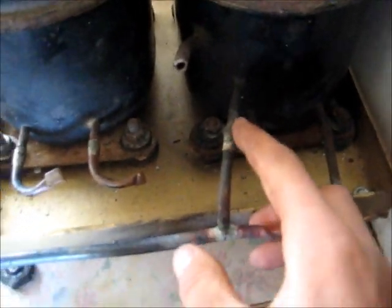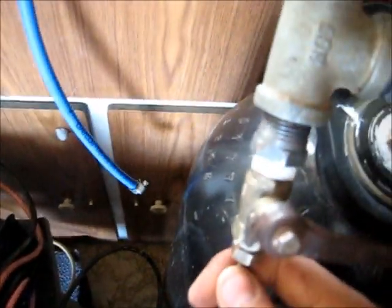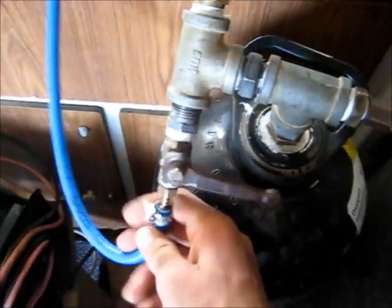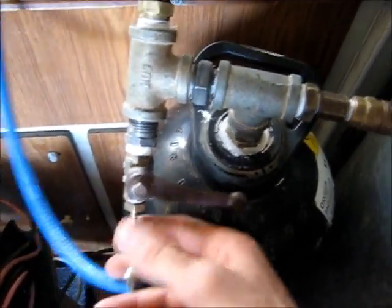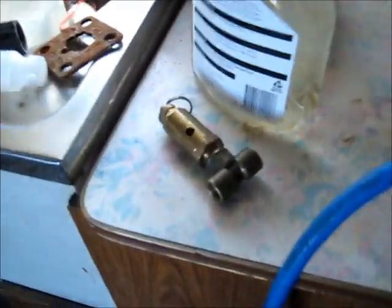But here I've got a leak point. I'll have to heat this junction up and get some more solder on there. Then I'll dump this tank, get all the pressure out, and we'll stick this dump valve in. We'll have to get that calibrated to exactly 120 psi for safety. If it gets too high a pressure, that will pop open — we'll install that here.